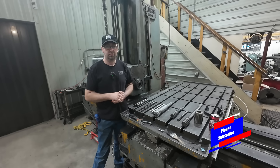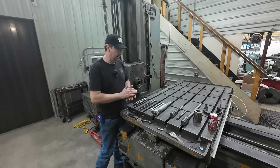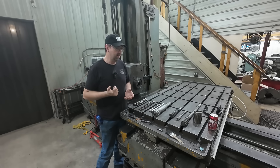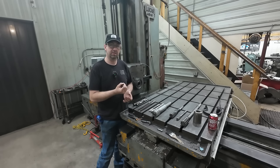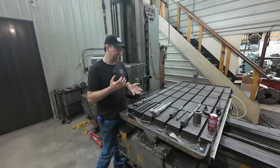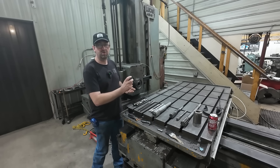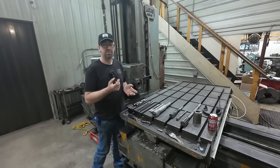I have a lot of shell reamers in fact — I'll show you the drawer where I keep them all. These are all my shell reamers that I've amassed over the years, many different sizes. There are many different styles of reamers and these are just the examples I have on hand. I've got them all the way down to an eighth inch up to close to three or three and a quarter inch. The thing with reamers is you're not using them to take out a lot of material — you're using them to take out minimal material and clean up the hole. They work best on a vertical spindle, but you can use them on a horizontal spindle as well. I find that on the lathe with flood coolant they work pretty well — it helps get the chips out of the way.